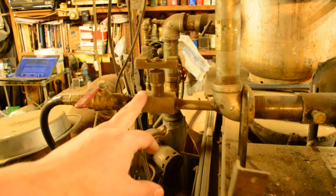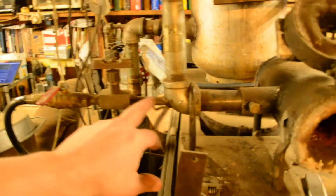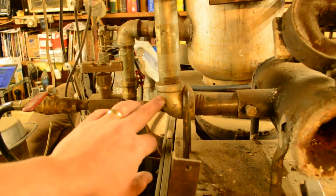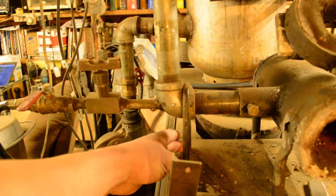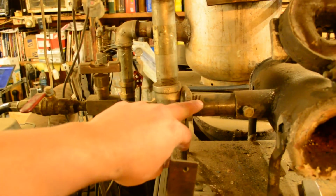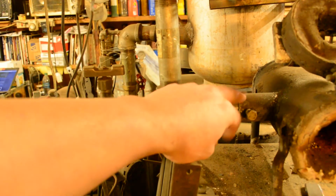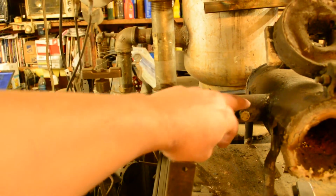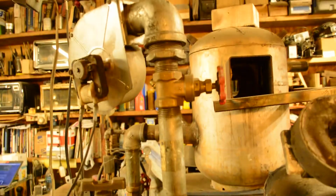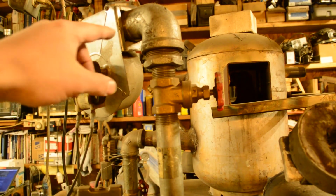So I'm not sure where you would get another one of these. Another 1/4 inch pipe nipple. That's going through a 1 inch 90-degree elbow. I have support welded on here to hold this up. It goes into another 1 inch pipe fitting, and then that goes into the burner holder that's welded onto the side of the body. For the air inlet here, we have the blower, which I've got another one that I can show you here in a second.